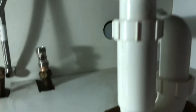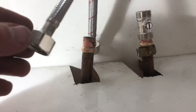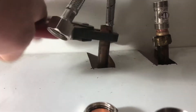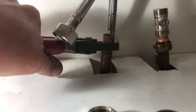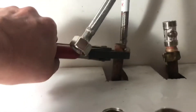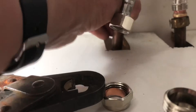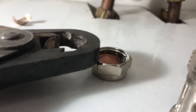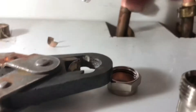Ideally you could go lower but we'd have to take the shelf out and possibly disturb the trap, causing hassle and money. So we're not going to do that. Get our olive splitter on — these are £60, you're not going to have one of these. So it splits in. Let me get that nut up and we can start again.